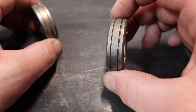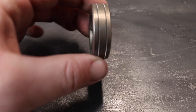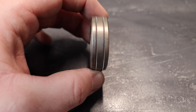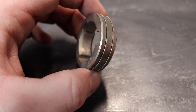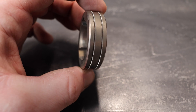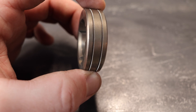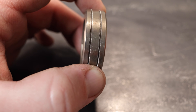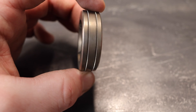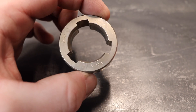The reason you can use a smooth roller is because hard wire can handle a lot more pressure and it won't deform or crush. With flux core you just can't do that, because the inside of that wire is full of flux — so it'll easily crush and deform. The knurls on the outside of the roller do more of a grabbing technique. If you crush or deform that wire it won't feed as well, and you'll have problems with it jamming or getting stuck in the liner, getting stuck at the tip, or balling up right at the rollers. Having the correct rollers and the correct roller tension is paramount.